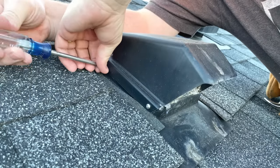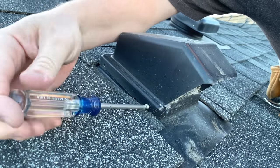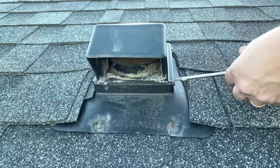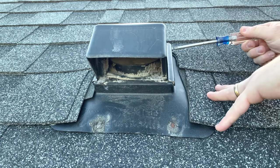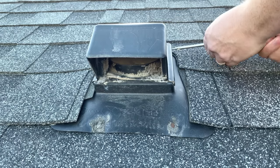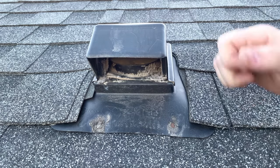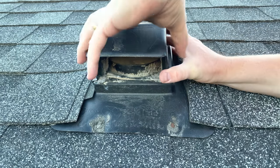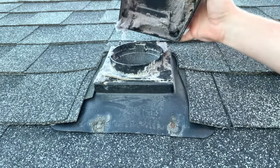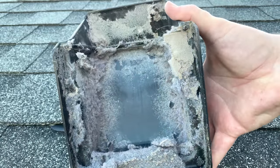Keep in mind that if you have a hard time discovering where your dryer vents on the outside of your house, it might be up on your roof. This surprised me — it's the first house I've ever found with it on the roof, but that's how my house is set up. It's actually a good thing because if they'd run it straight out of the house from where the laundry room is, it would have been right next to my air conditioning condenser. If you're not comfortable getting up on your roof then skip this step, but if you are comfortable it's a good idea to get up there, disassemble it as much as you can, and remove any built-up lint stuck in that vent — as you can see they can get pretty nasty.